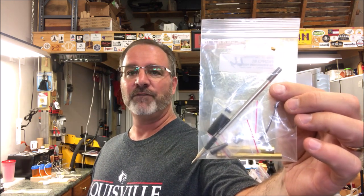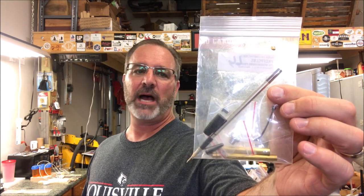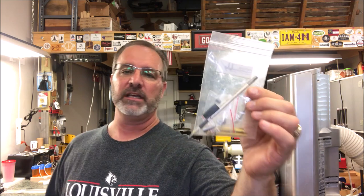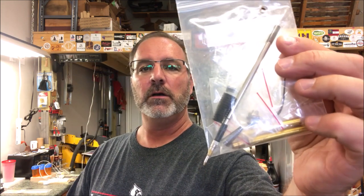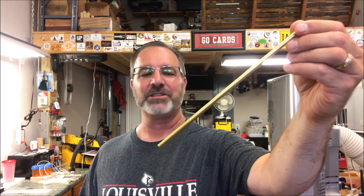What I have here is a Comfort mechanical pencil kit, and I got this from Penn State. It's been in my shop for several years, before I moved into this shop, I do believe. You'll notice it has two blanks down on the bottom. It's normally a two-piece kit. What I do is I order these 10-inch long 7mm tubes, and I also got this from Penn State, and I've had these for a long time as well. We're going to use this tube and this kit, and we are going to turn a one-piece solid blank mechanical pencil today.